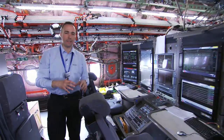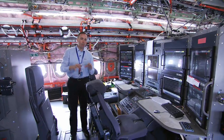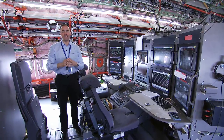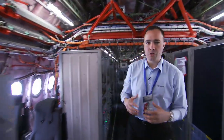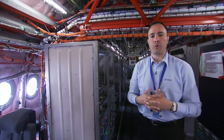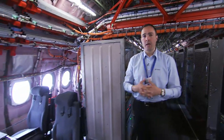From this station we also have the possibility to communicate with the various computers of the aircraft and to change some of the laws inside those computers. For example, we can change the flight controllers — we can increase the gains of some schedules to make the aircraft more responsive, lazier, or more suitable to what the pilots identify during flight. It's not only the flight controller computers we can control, but also the computers for braking, air conditioning, ventilation, and so on.